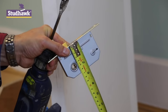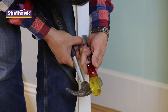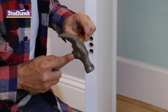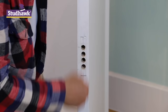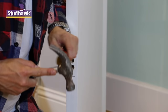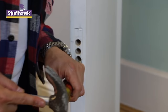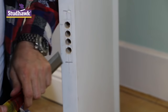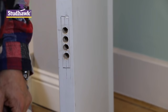Now what we do is look at our lock — 65 millimetres. To chisel out the mortise lock, choose a suitable size chisel. What we're going to do is drop that chisel into the scratch mark. When you're chiseling this way, you're normally chiseling with the grain and it tends to want to split the door. So your first row of chiseling should be quite gentle. Don't whack this in too hard or you'll split your door.